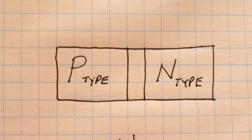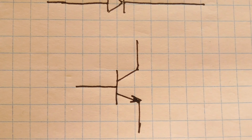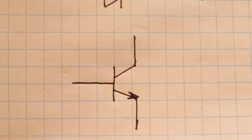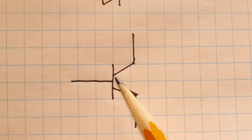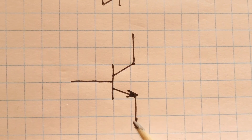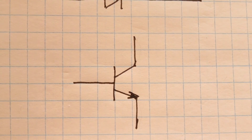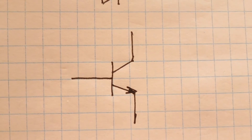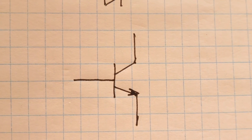Going in the other direction, when temperature drops too low, it affects the doping on the PN junction so it can no longer ionize and create carriers. When we inject base current into a transistor, we're injecting carriers to cause a larger collector current — that's the HFE or beta. When it gets too cold, a condition called freeze-out occurs: no more carriers can be injected, the transistor fails, and the microcontroller fails.